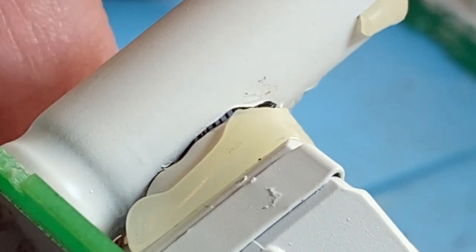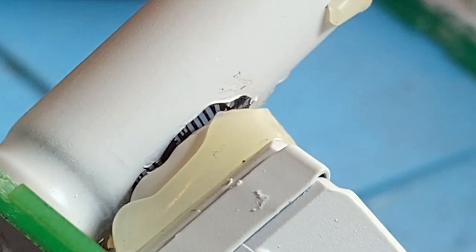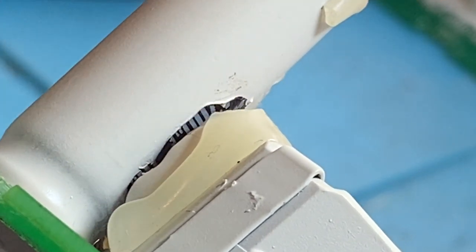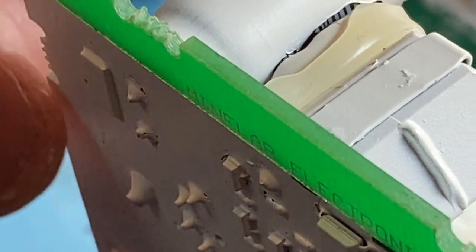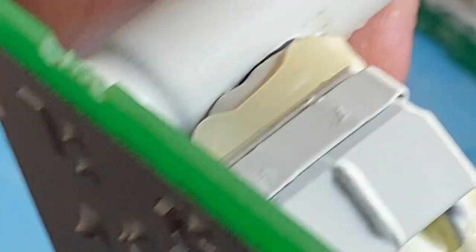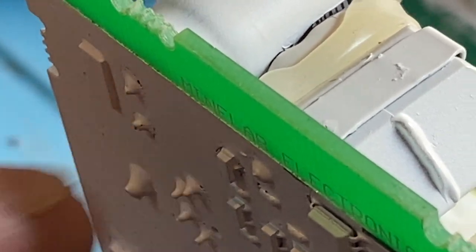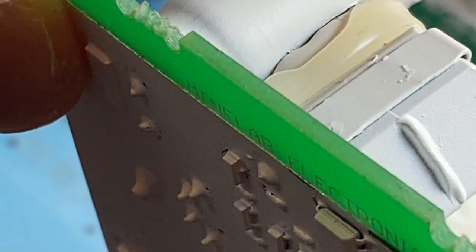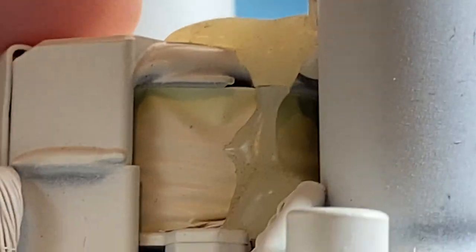That, right? If that pulls sideways, that's okay, because the pins are not in that plane, they're running perpendicular to the movement there. You can see where they are, those two pins. It's rocking that way, on the pins. But if it rocked to that side and that side, those pins could have pulled out, and maybe you could fix it. Push the capacitor down hard with your finger, like so, and get someone to re-solder them. It can happen.